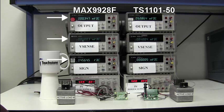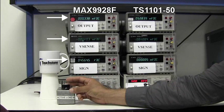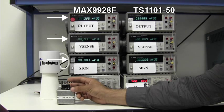If I now increase the sense voltage from negative 1.2 millivolts back to negative 5 millivolts, you can see how the output does not respond until the sense voltage reaches approximately negative 1.8 millivolts.